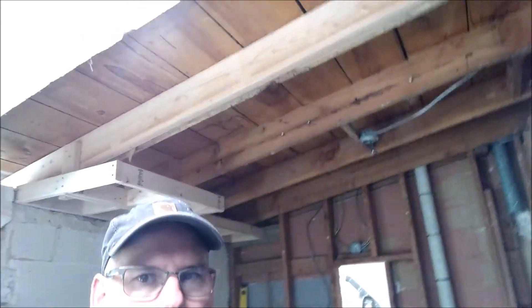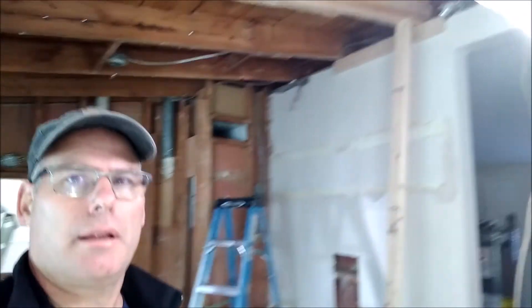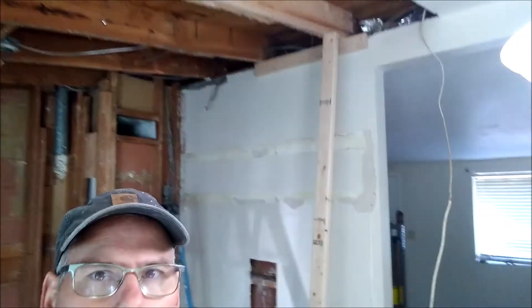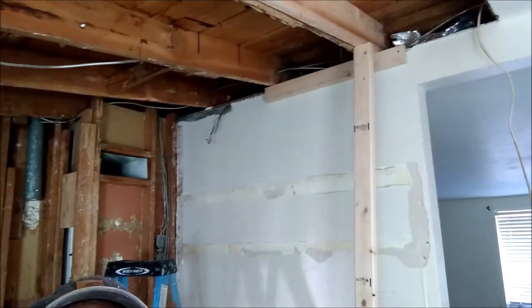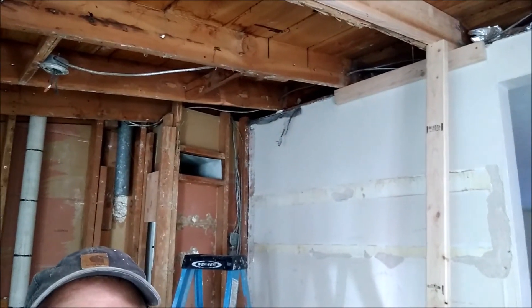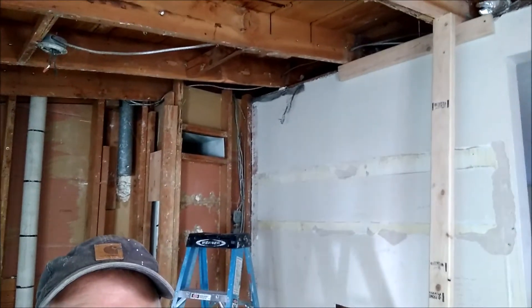It's actually the next day. I wanted to show you how this rafter turned out — you can see I got it in place up here. I still have a post there because I still need to get something underneath it to hold it up tight against the ceiling, since the plate is a little disintegrated from the termite damage.